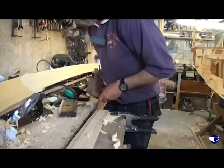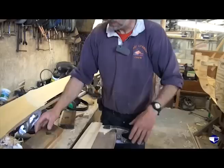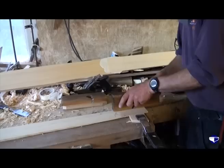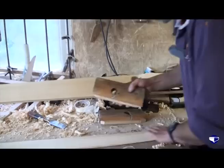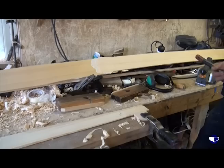That's about it; we can tweak it finally when it's on the boat. Just run our thumb along it, make sure there's no lumps and bumps. Now we just need to turn our plank over and do the same on the opposing side. So that's our phantom mark — that's where we run out to nothing — see which plane is going to work for us this way.